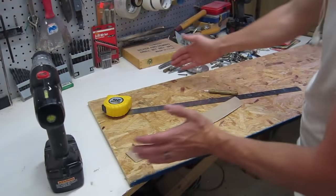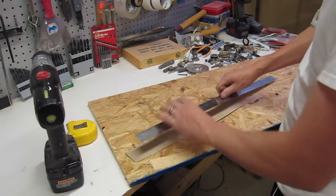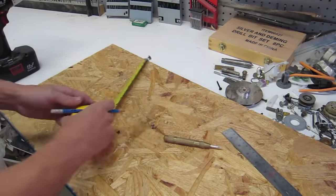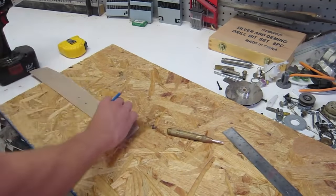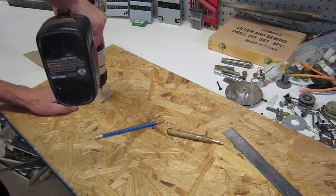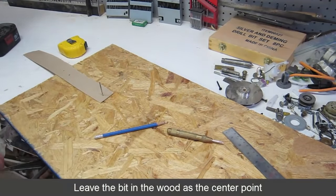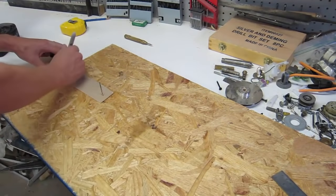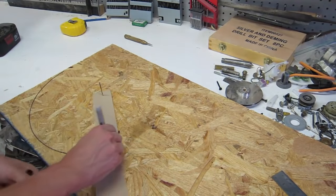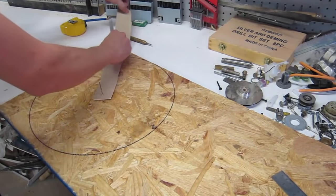The first step is determining how big to make the circle. This is just the scrap I have lying around that's 16 inches. So I'm thinking I'm going to make it 15 and a half, just so I have enough room. I'll screw into that center hole and leave that bit right in there. When I take a Sharpie out and draw this circle, it'll hold it right in place, and this will be the 15 and a half inch circle that I'm going to use.